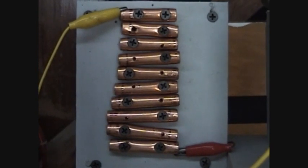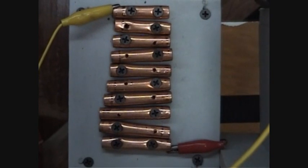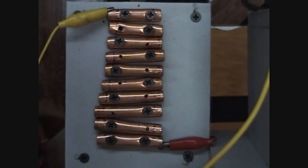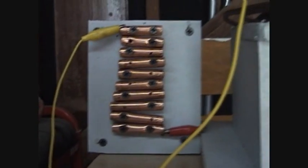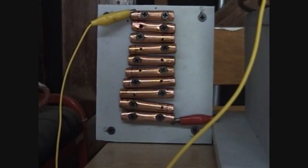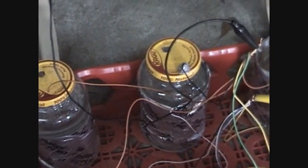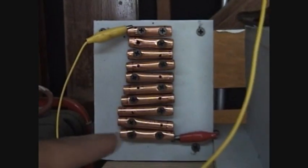It's a multiple spark gap and this drastically reduces the noise — the noise went down at least in half. What it does is if your spark gap is, say, an inch, over that inch your capacitors will start popping — pop, pop, pop — because they're trying to discharge through there instead of through here and discharge properly.